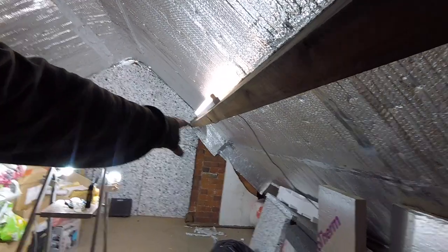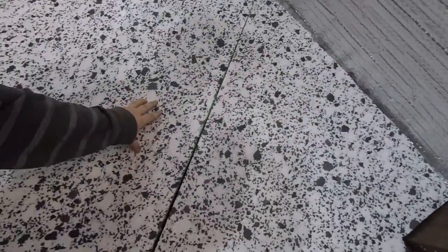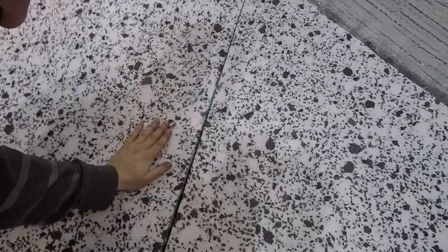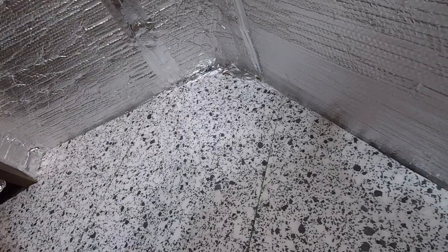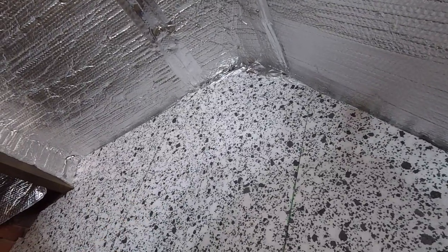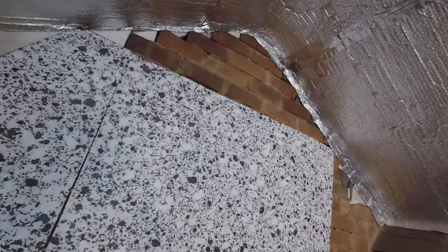The chimney breasts I'm leaving - a little bit of air coming out of there. I've cut these boards here to size and stuck them on with a spray foam adhesive, Pink Grip Dry Fix - sprayed it on the back and just applied pressure. There's only a few dabs on there, so in future if I want to take them off it's not a big drama. It's about ten quid in materials just to try and insulate that wall a little bit, then I'll tape up these edges. At this end I've run out of thin inch-thick styrofoam, so I'll get some more and just do the top piece and the strip there - just to take a bit of the coldness away from the brickwork.